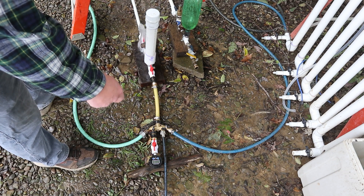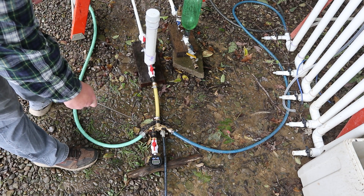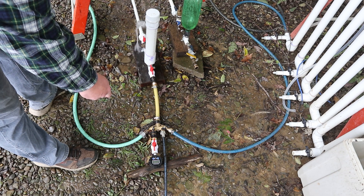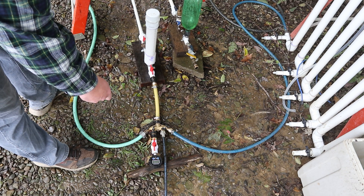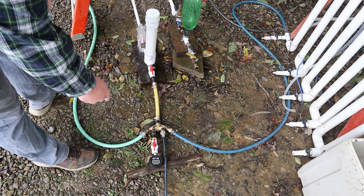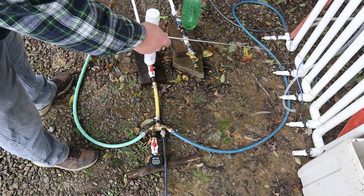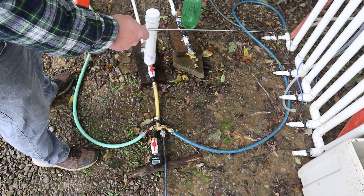The three testing methods I want to try here. This one is just a normal delivery pipe that runs way up the hillside, regulated by a valve. By turning the valve on a little bit we can match the back pressure as measured by this gauge here, and make sure that the back pressure created by the valve being partially shut or partially open matches the other two methods. The third method is my artificial back pressure device, which is a forced airlock system — and that's airlock in the terms of piping systems, not space travel.